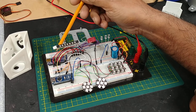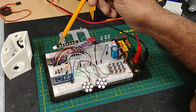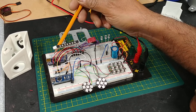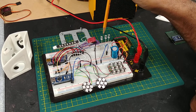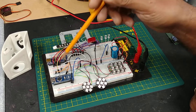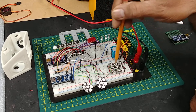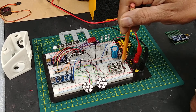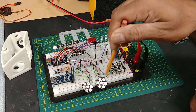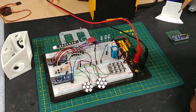I've got two Nanos: one Nano controlling the seven LEDs that scan and the six that scan. The three in the back just blink and change color on their own. The second Nano controls all the NeoPixels — it'll do a little display, stop, set to a certain color or intensity level, then turn the jewels on, stop, and go back and forth. That's how it's all going to work.